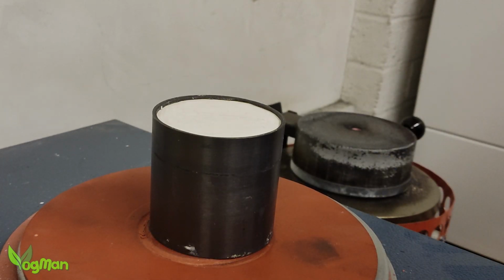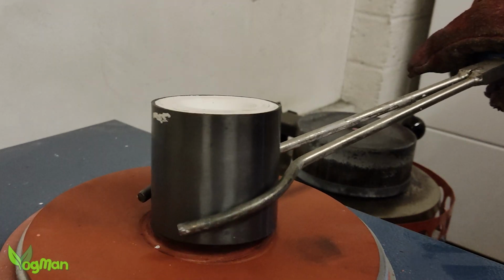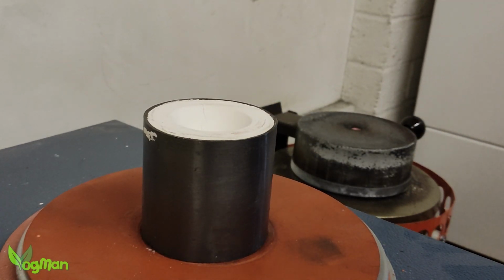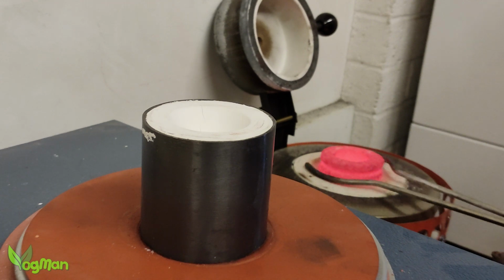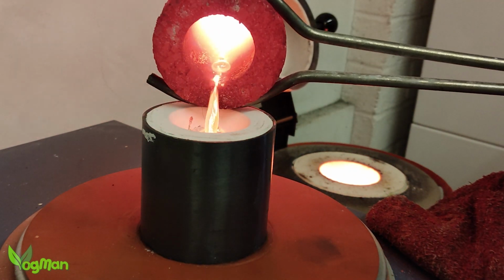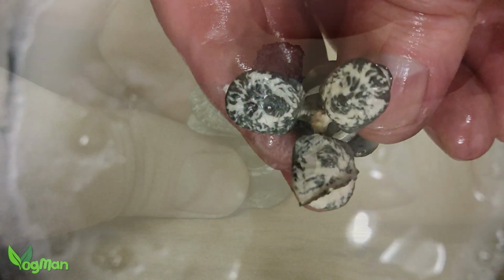Have you noticed the obvious mistake? The flask is upside down. Whether or not it was all this faffing about, the plaster cracked slightly during the pour. And sure enough, there was a nasty bit of flashing across one of the castings.